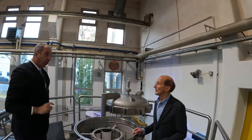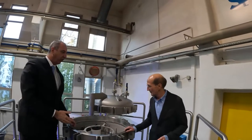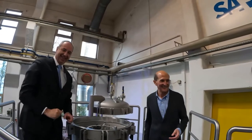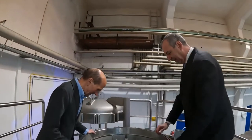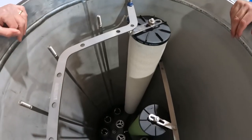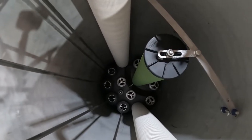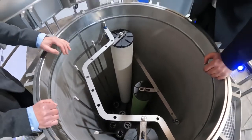Now we should have a look at the next step. After a micro filter, as an airport, we'd expect a filter water separator — let's go have a look at it. And this is enormous. It is a rather big one. We talk stationary vessel here, and after the micro filter we want to have a filter water separator because we want to take out the water. The dirt is being taken care of by the micro filter and now we look at this one.